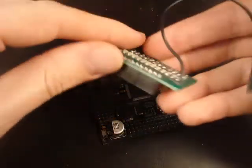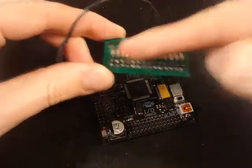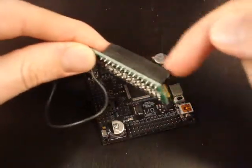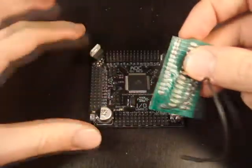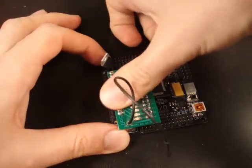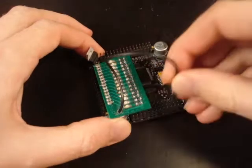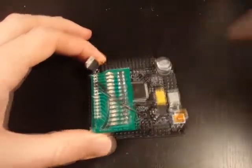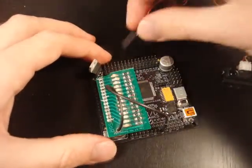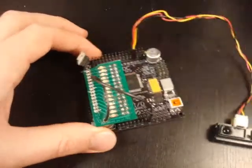The next thing I'm going to show you is this LED array — 14 LEDs and 14 resistors, a custom circuit I made. It has a female header that plugs right into the digital I/O on the far left. I also plug in a ground wire wherever I want. This circuit is going to be controlled by a Sharp IR sensor, which I plug into analog line 12.